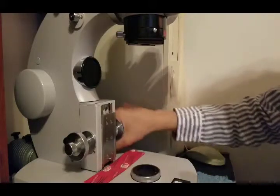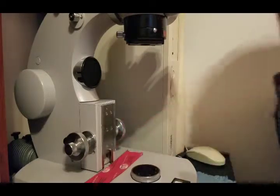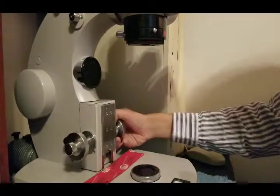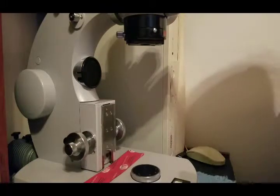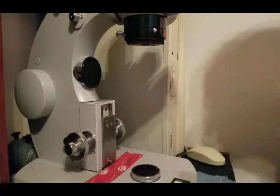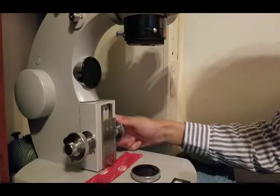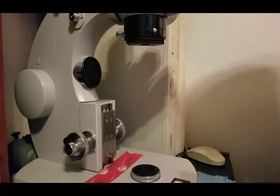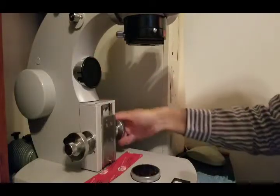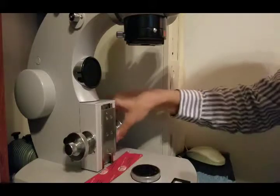Now we're getting to a part which is the biggest problem for this microscope, and it's something that took me quite a while to work on. It's a problem that a commenter asked about on my previous video - his Z axis got stuck. It's highly complicated to get in here. You can take off this front plate and it doesn't really get you anywhere. Oftentimes these brass plates will also be layered in lithium grease and that could also seize - there's a larger surface area there and that's what caused most of my problem. I wanted to get out all of the old lithium grease from the inside, but you have to take off the entire side plate to get to the inside. You can't reach the gearing from outside, which was a major pain.